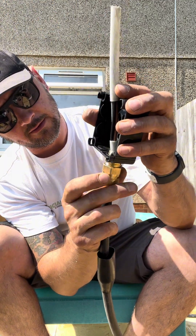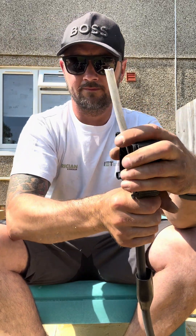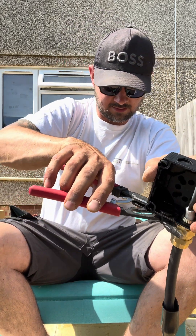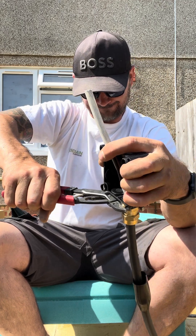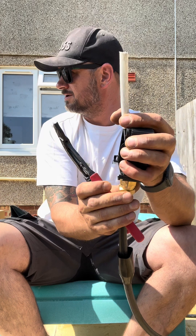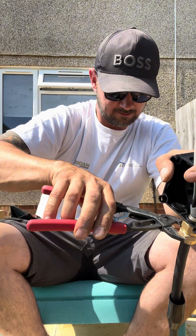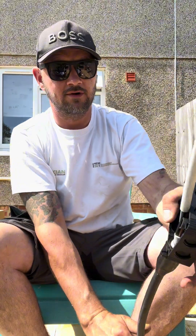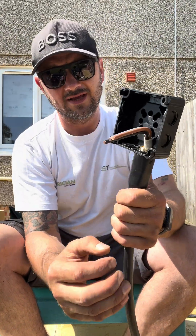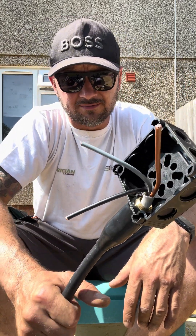As you can see, this is in the gland so it should clamp on, giving a nice tight connection on there. Do that up, get your grips — there we go. Bring the shroud up — spot on, looks beautiful. Now what we've got to do is label the live, neutral — which is the gray — and the earth, ready for when the guys want to install the hot tub. So that's what this is for, it's as simple as that.